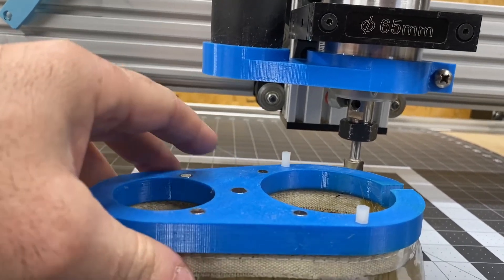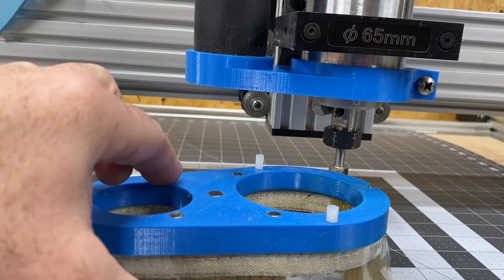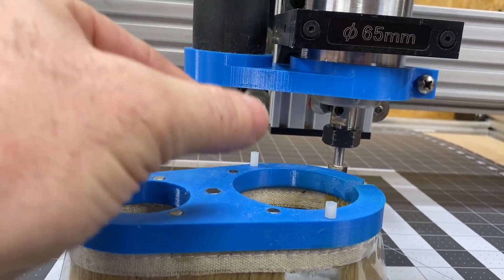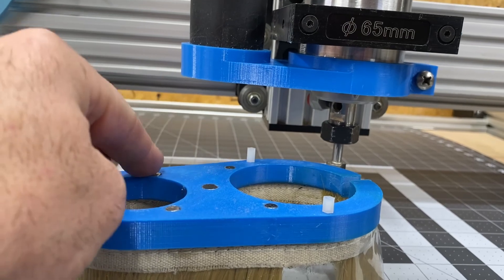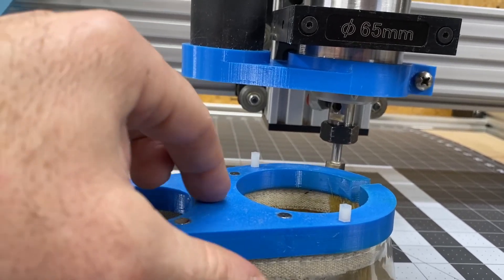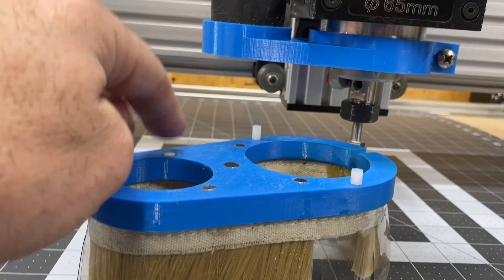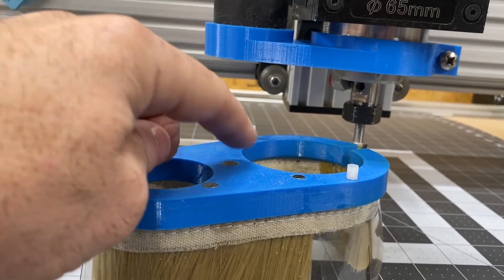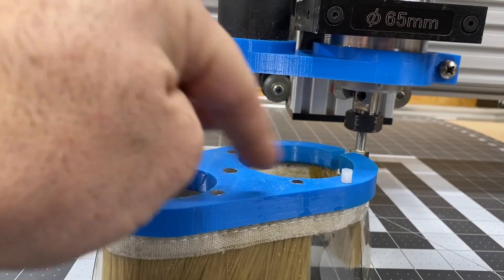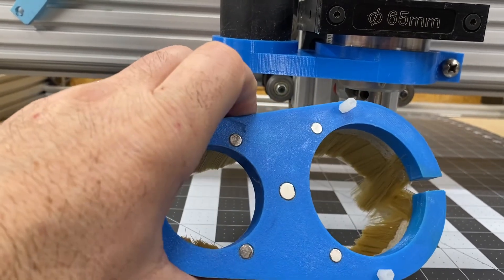The bottom shoe I made in two parts — two versions. Version one is a trench version where the top part of the lower shoe is flush with magnet-recessed holes in it. The holes are tapped down with a countersink cone that allows epoxy at the bottom of each magnet to be pulled down there to hold it nice and strong. These are standard neodymium magnets — six millimeter by three millimeter, and eight millimeter by three millimeter in the center — which you can get on Amazon.